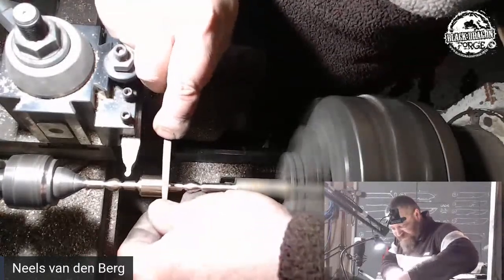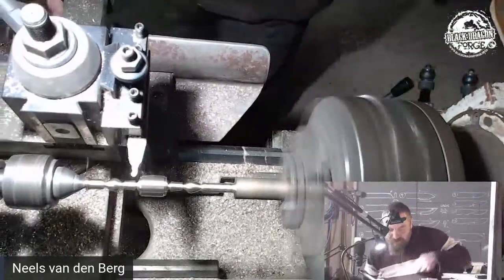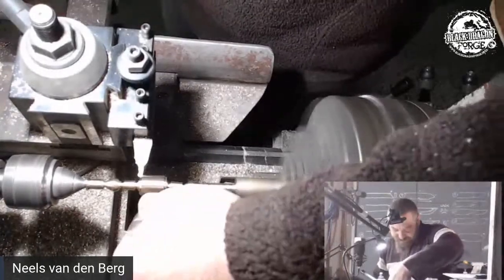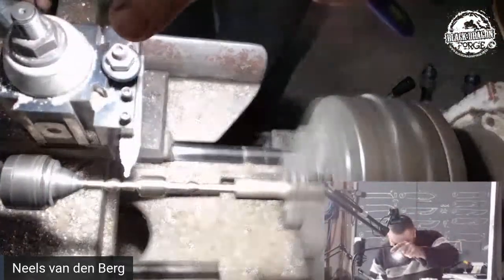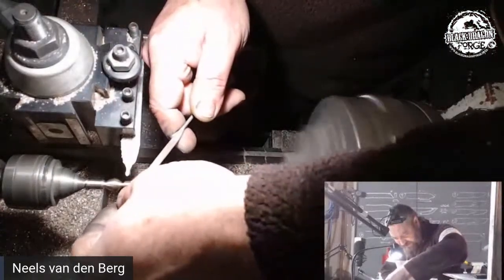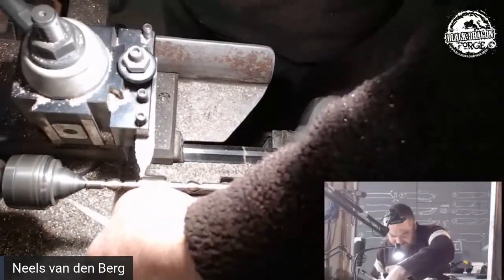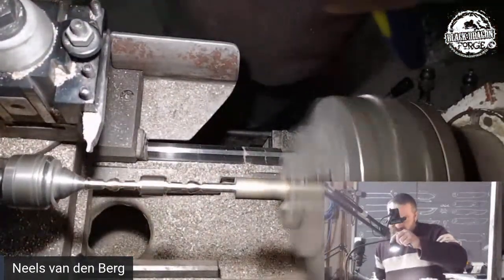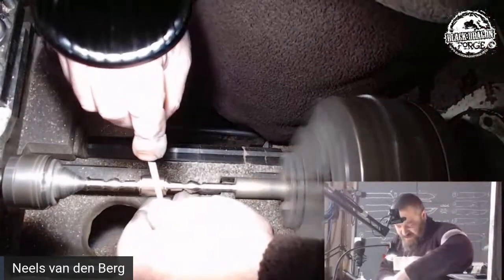Actually, see how blunt that cutter is by that burr it's leaving. Okay, so I just want to cut those so that they are in the same width region, because I can manipulate that with files, which is the preferred method. Yeah. Okay, so let's go on to the files then. Get this baby out of the way completely. Does anyone have any questions so far? I see someone has written a little short story there.